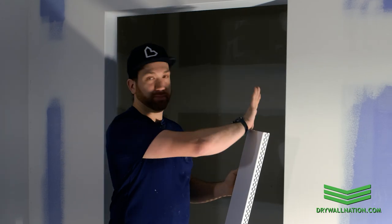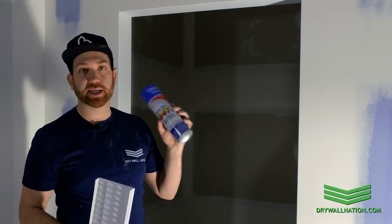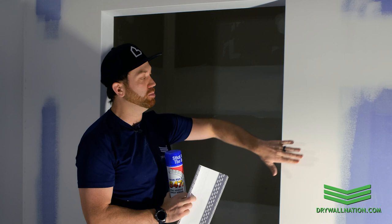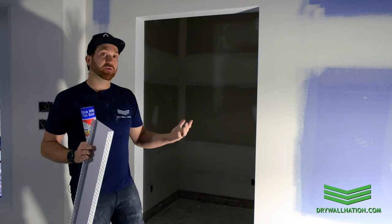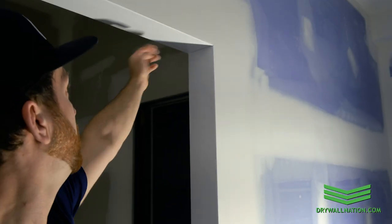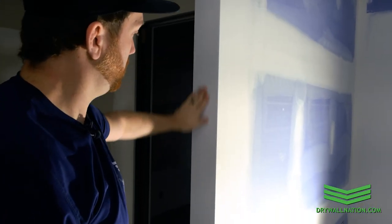The vinyl finish completely covers that opening, so it just clips over the front like that. You install it with your Trimtex drywall adhesive as well as a few staples, and then you only need to mud the front and back side — you don't need to mud the face, as that's pre-finished. Conventionally, if we were to do this with regular corner beads, we would need to install six corner beads, as opposed to simply three pieces of the Trimtex Fast Cap.